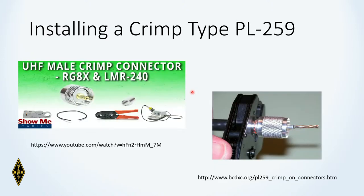I use crimp PL259s, where you solder the center conductor. That's no problem. But instead of soldering the shield, you crimp the shield. And I find it gives a much better, more stable connection, fewer intermittents. Just my two cents.